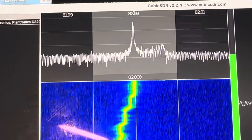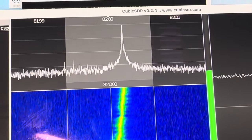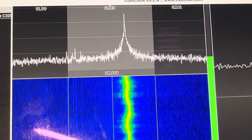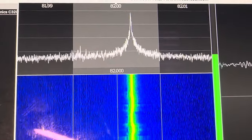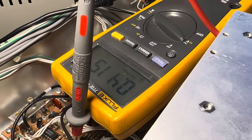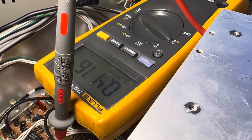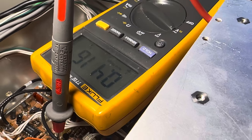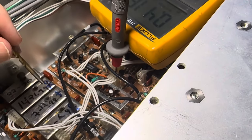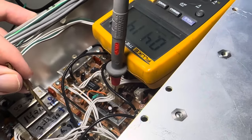I'm turning up and it's kind of jumping. What that tells me is the charge pump is trying to do its thing, and the oscillator is just not completely working correctly. You can see that the value for it is rather high. If I attempt to lower that by putting some inductance in, it will really lower a whole lot — it'll attempt to lower, but then it will go up. So that lets me think that at least this coil is close to where it should be with the inductance in it.